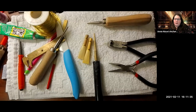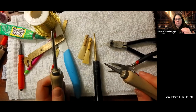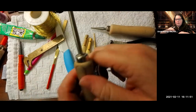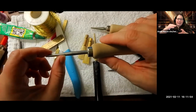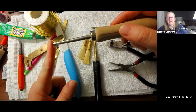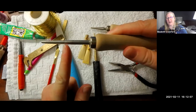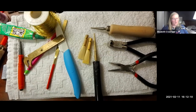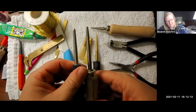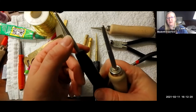I had a question, if it's okay to ask. Yeah. When you're using the second mandrel, the forming mandrel, and you're putting on the second wire, the bottom wire, is there a certain point at which you line up the bottom of the tube with any point on your mandrel to get it the right shape for your bocal? This is the holding mandrel made by Adante Arondo. And so, yes, it has a line here, and that is the reference point. But I'm pretty sure it lines up at the same circumference as these markings do.